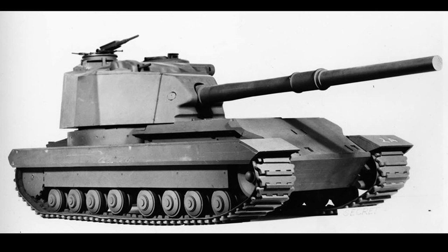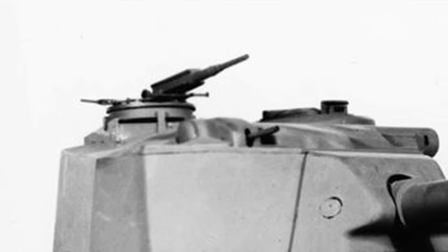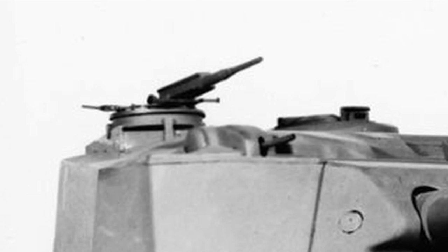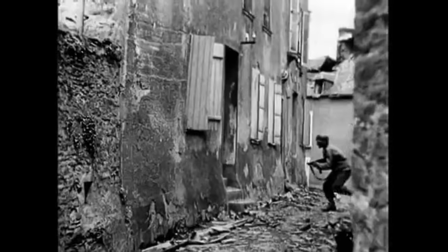Having the gun at the rear also made the vehicle a more stable firing platform, as the front half of the vehicle would act as a counterweight to the recoil force, preventing the vehicle from tipping too far backwards. As well as the roof-mounted machine gun, the secondary armament consisted of a coaxial L3A1 .30 cal machine gun — the British designation of the US Browning M1919A4. This was not coaxial in the traditional sense, as it was not integral to the main gun mount. Rather, the machine gun was placed in a blister cast into the roof with the rangefinder at the top right corner of the turret. The L3A1 had the same vertical traverse range as the main gun, and six boxes totaling 6,000 rounds were carried for it.